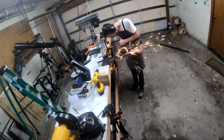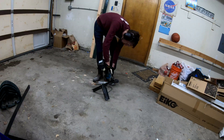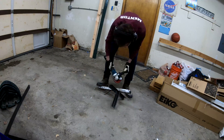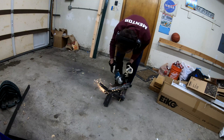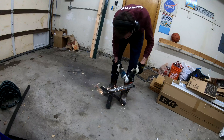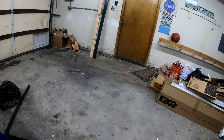The vertical part of the launchpad is made from this Unistrut channel, and I had to grind the inside of it flush so that the launch rail could slide smoothly in and out of it. This ended up being the most tedious part of the whole launchpad construction process, and it just took a whole bunch of very careful finesse work with the angle grinder.